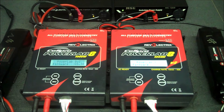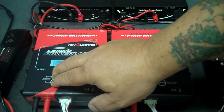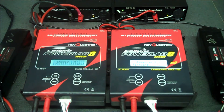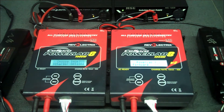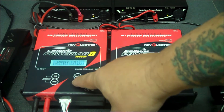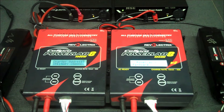Next you're going to determine which charger is going to be your primary charger and which charger is going to be your expansion channel. I'm going to use the left charger as my primary charger. To confirm, we press both the increase and decrease buttons to go into the choose task mode, then hit the increase button once to go into charger options, and press enter until we get to the charger address — making sure that it is set to primary channel.